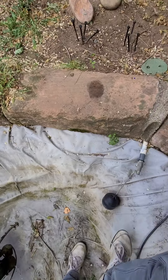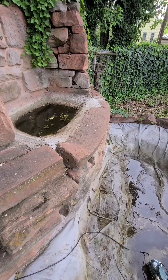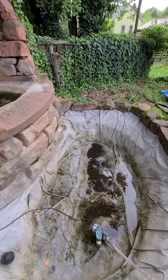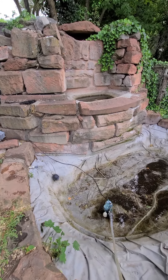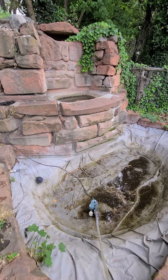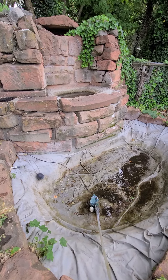So I'm gonna fill in all those holes with spec mix and redo the top with spec mix, then just take a look at other places on it to see if there's anything else. I'm gonna tint it a little bit red so it looks more like these stones. Then you gotta let it sit for about 24 hours to dry, and then we should be leak free. That's the goal for today — thanks for watching.